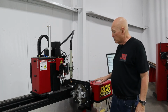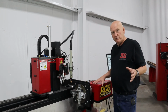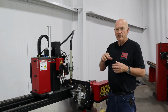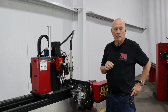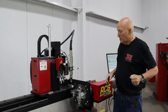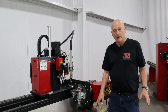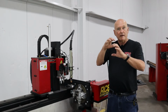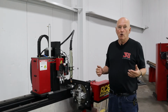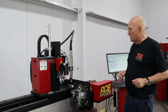So the next thing we're going to need to do is align the power head up or down. In the previous video, I had already set the power head to a correct height. You need to watch that video. I described in it how to take a 10mm bolt with a nut and a coupling nut and make an adjustable spacer that, once you lock it down, whenever you're going to put a stabilizer into a machine, you simply place that bolt underneath the lifter plate, let it rest down on that bolt system that you just adjusted, tighten your lock nuts down, and you're good to go. You don't have to keep adjusting, doing what we're doing. You're only going to do this one time. Anyway, watch that video, you'll see how that's done.